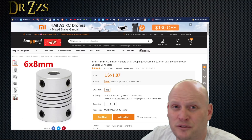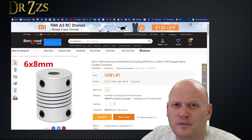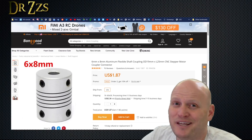These metal couplings are used a lot in 3D printers. If you're going to do this, make sure that the one you buy is going to fit the two shafts. For me, this one should work — the motor shaft is about 6mm and the shaft on the window crank is about 8mm. If I keep stripping out PLA couplings, you can bet I'll be buying some of these.